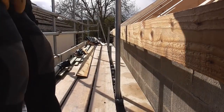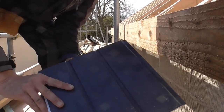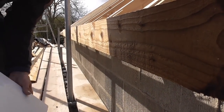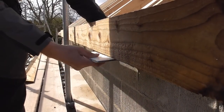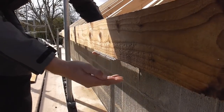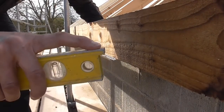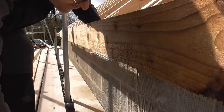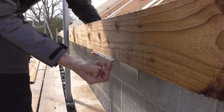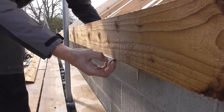What I'll quickly show you actually — there's a bit of soffit here. This one's been done already once, so we've got a bit of soffit here. And as you can see, that soffit just slots in there and we know that it's exactly at level with the blockwork. Because I've allowed that little nick on my level there, it's going to be perfect. So this will then just get a pin through the end here, and then when the fascia goes on, the fascia will just lip over it and obviously cover that pin.